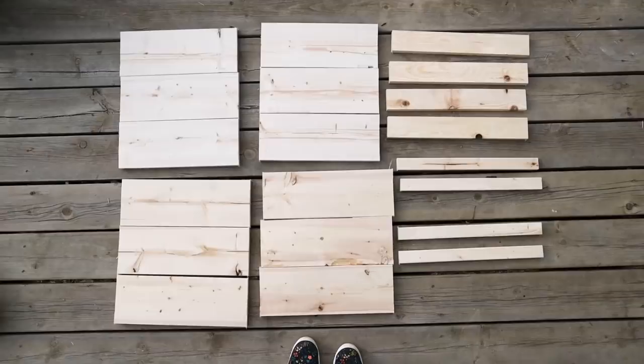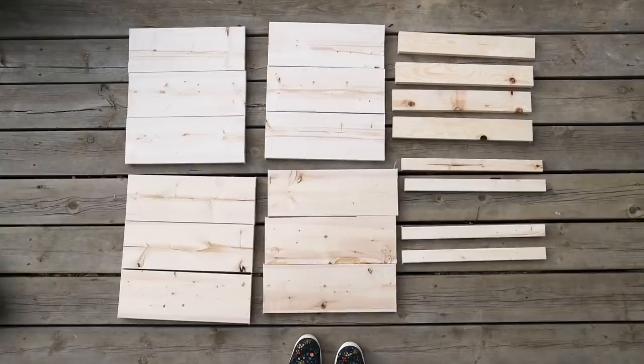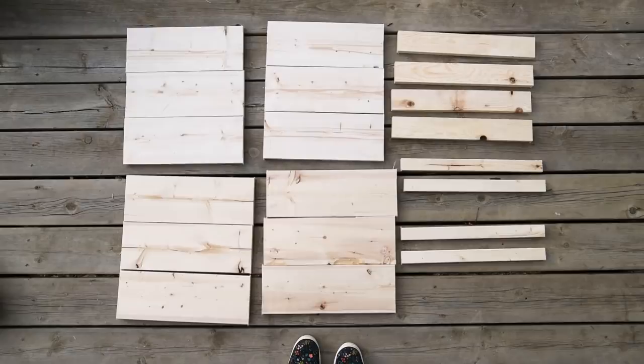So here are the cuts that you're going to have to make. I cut 16 pieces that were 14 inches long of 1x6s. I have 6 pieces of 1x6s that are 15.5 inches long. And then I have the 1x3s and the 1x2s. I will leave all of this down in the description box below so you can check out the cut list for yourself.